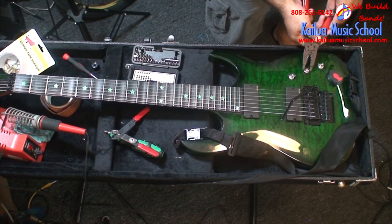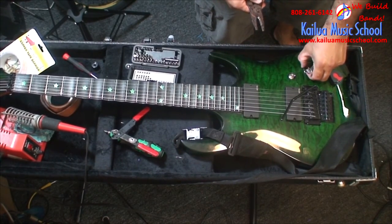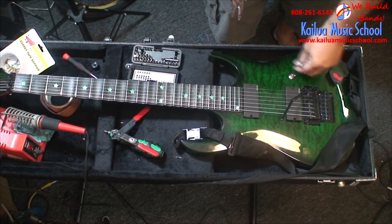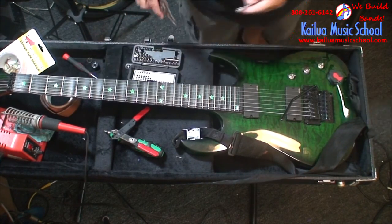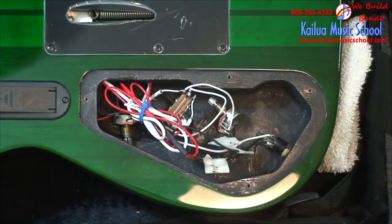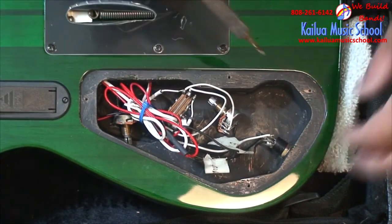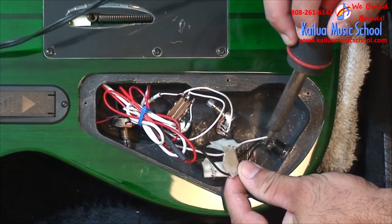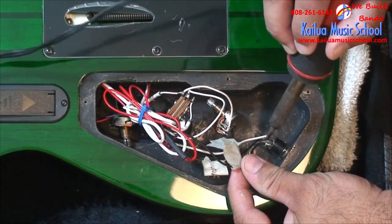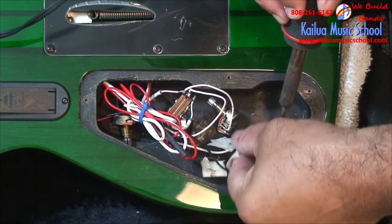So the first thing I'm going to do is just take apart the guitar — take the knobs off, take the cavity covers off, and try to get everything out of the guitar so I can lay down a row of shielding everywhere. I'm going to tie all that shielding together with ground straps. When you get to your main electronic controls, you might want to label them and tape them off the way I did here, then de-solder them from the jacks and pull everything out.